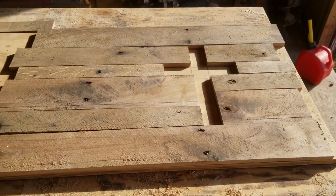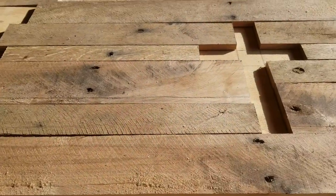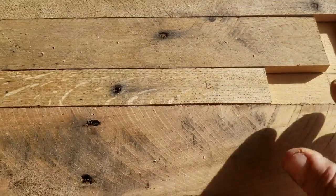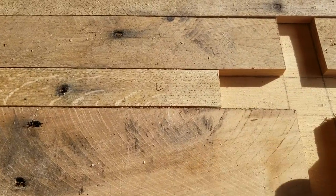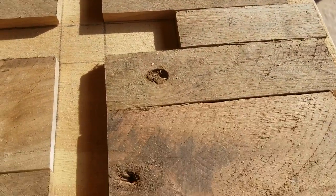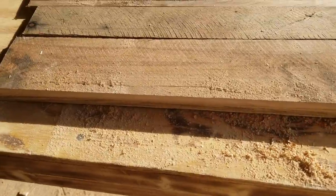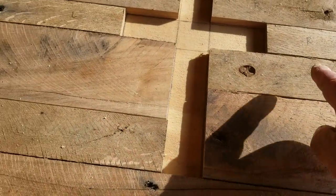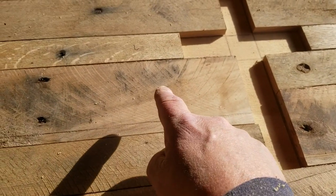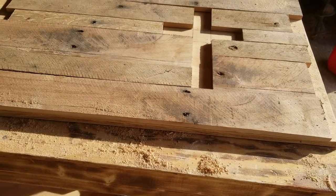Ta-da! As you see, my cross is cut out — isn't that pretty? I got the edges staggered. I will say one thing I forgot to tell you: when you do this section — the inch and a half — you will have to make adjustments on the end, because everything's 24 inches except for this. You have to allow for that; I had to cut off some on both ends to get it proper. The five and a half inches — I take a board three and a half and then two inches, stagger them: big one on top here, little one here, little one up here, big one down here. That's basically how you build these things.